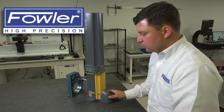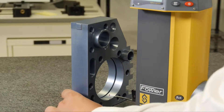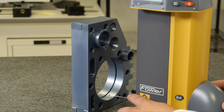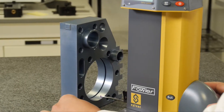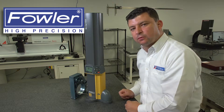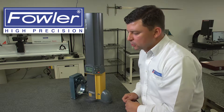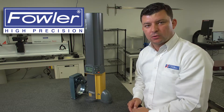To show you this operation, we'll drive into our bore in diameter mode. We're going to be slightly off-center from our reversal point. We will engage our probe. At this point, when our probe is engaged, there's a constant measuring force that's going to sit down on that probe so we can tram through that surface with the probe maintaining contact through the contours of the bore.